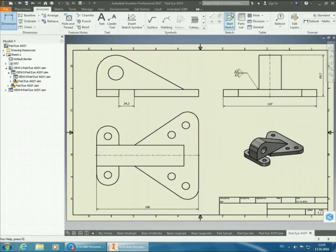It is also usual to put in center marks for holes. Here we don't necessarily need to place a center mark on curved edges because we're not going to manufacture this part. It's already been manufactured, so the fact that this curved surface shares the center point with the hole doesn't really matter in this case. So we're just going to put them on the holes. And the main reason for using center marks on holes is just to show that there is a hole here. So here we have a cylindrical feature going through the part.